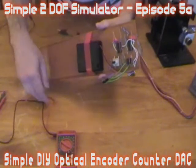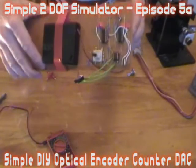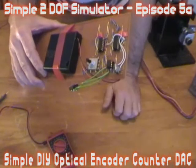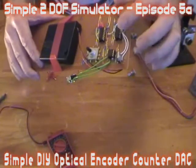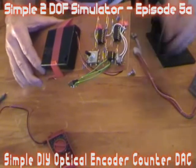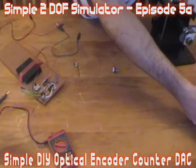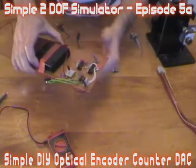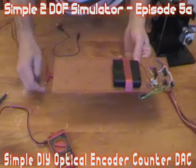This particular circuit steps 256 times to read zero to five volts. If you put another 4-bit DAC on, that changes it, but I don't think we need more than 256-step resolution. That equates to — if I bring out my linear actuator — it's a 300mm linear actuator, and if I use say 256mm of that 300, that equates to 1mm per pulse of movement control or feedback, which I think is good enough.